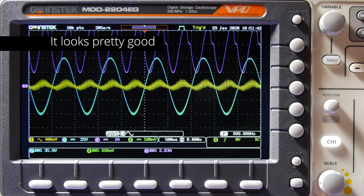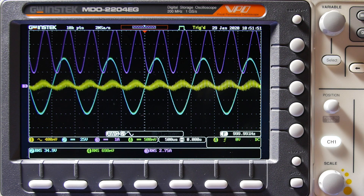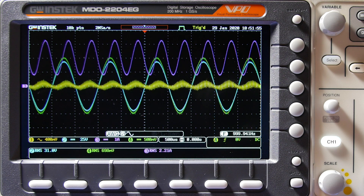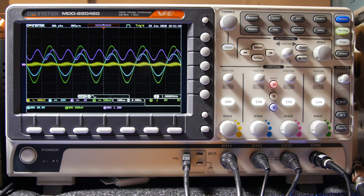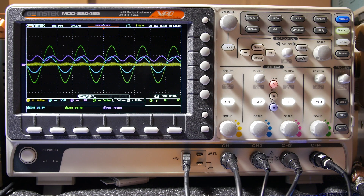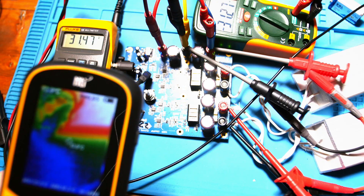You can see the ripple voltage — that yellow trace, that's 400 millivolts per division. I'm at 37 volts and it's just starting to get clipped right there, so around 35 volts. That's pretty cool because I only got 31 volts coming in. If you wanted to get some of that ripple out, you'd just have to add some more capacitors to get a flatter line. That's something you want to check — how clean your power supply voltage is.